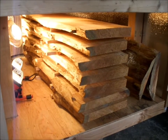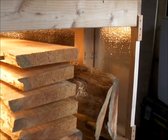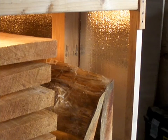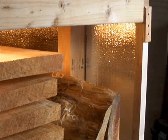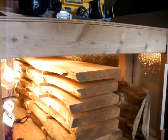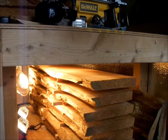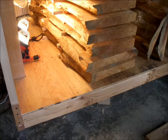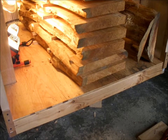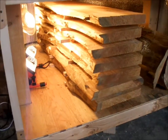What I have on the outside — let me zoom in here — I installed a few of these panels. I've got right here some panel insulation. It's got a reflective side; I put that side inward so it's going to reflect more heat and keep more heat inside. I've also got them on the top, in between the joists on the top side of the workbench. I didn't put them on the bottom side — this is my second time drying some wood and it seemed okay without them. I am able to get up over 130 degrees Fahrenheit, so I may add them later, but it's really not essential.